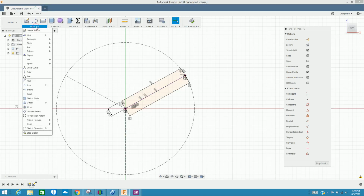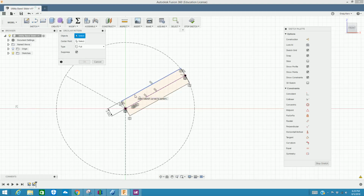Instead of drawing it three times again, I'm going to come over to the circular pattern tool. This has been covered in some of the other tutorials available on our channel, so if you want to check those out in a little bit more detail, go ahead. But again, I'm just using these as applied to this Haven Labs project. Go ahead and hit circular pattern. And I get to pick everything I want to pattern. I don't need those center lines anymore. And I probably don't need these lines either, but I'm going to pattern them anyways.